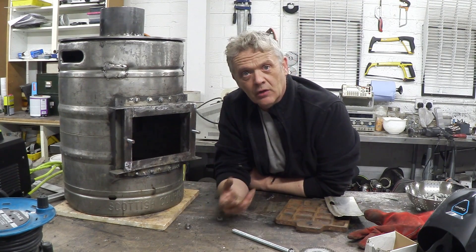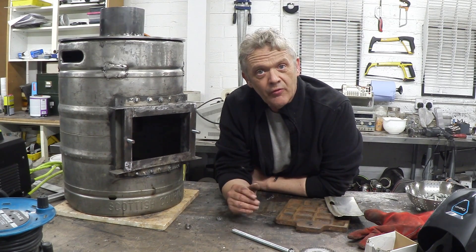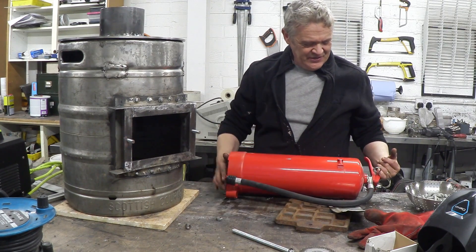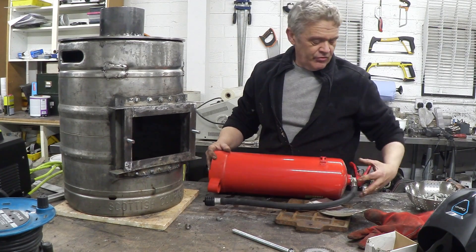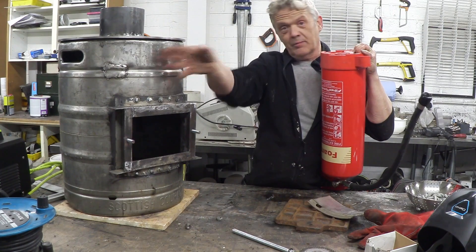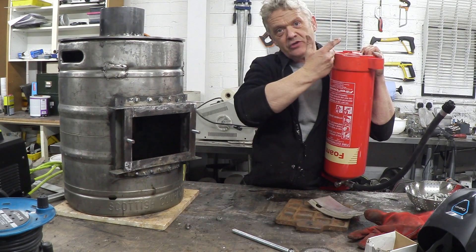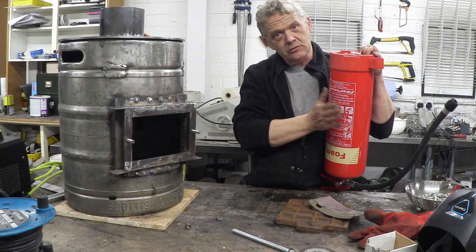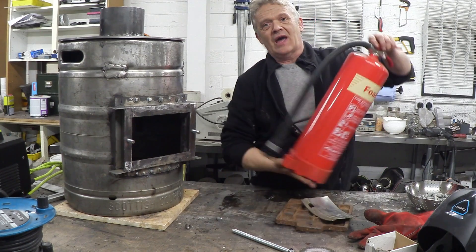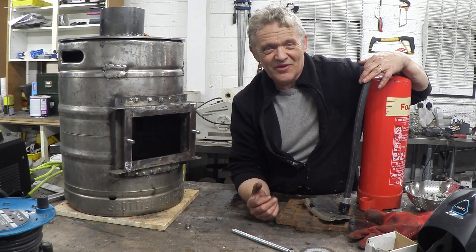The first stage filter is a cyclone filter — it's very little more than a large tube with an angled entrance and a smaller tube inside, lower than the entrance, where the exit is. What I've got for that is a fire extinguisher. I'll take the top part off, leaving a threaded section, and put a trap at the bottom. The gas enters at an angle, has to spiral round because the exit is a long tube going down, and then comes out to the next stage. The spiraling causes particles to collect on the outside and drip down into the trap at the bottom. So the cyclone filter is the next thing to make — I hope you enjoyed the video, thank you for watching.